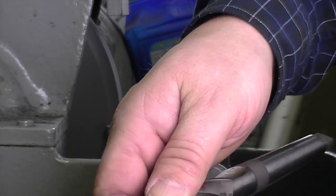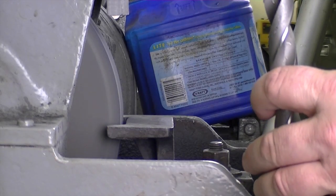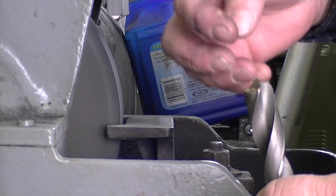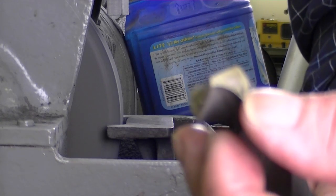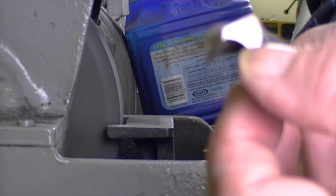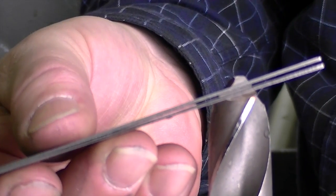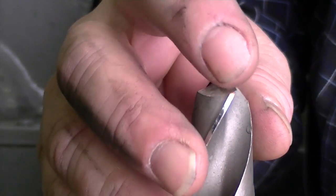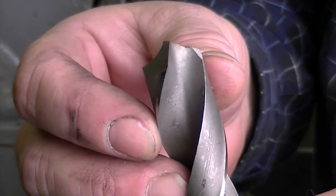It just took a touch — now it's 12 and a half on both sides. The chisel point is now in the middle of the drill, which means the drill will not cut oversize. I've got a very nice grind on the primary on both flutes. Now I just need to get rid of this heel, because if I don't, when the drill rotates the heel will rub and the drill will not penetrate the material. Notice the angle on the primary clearance when viewed from the edge — it is positive. If it were negative, I'd have to re-grind it, which means I was holding the shank too high. You must lower the shank to get that positive rake on the primary clearance, otherwise the drill will not penetrate the material.